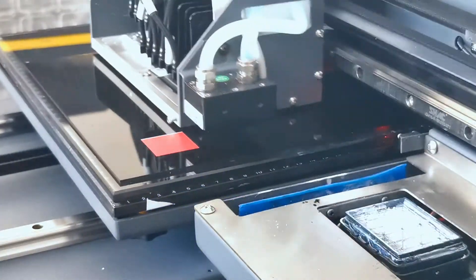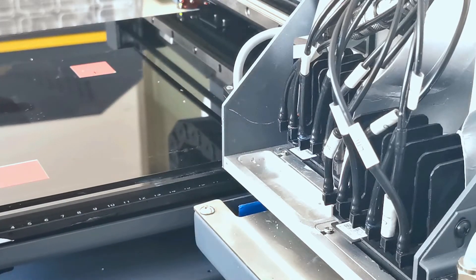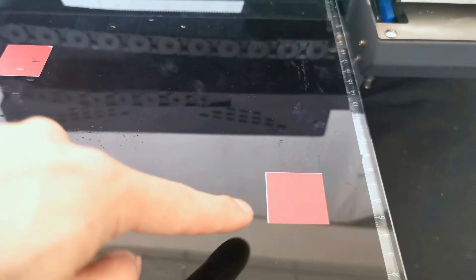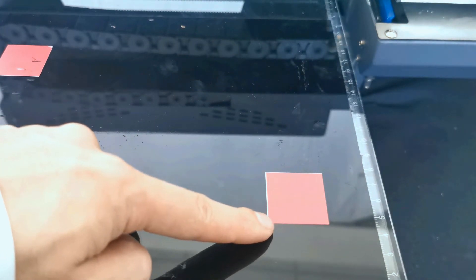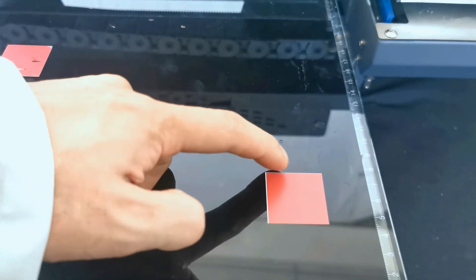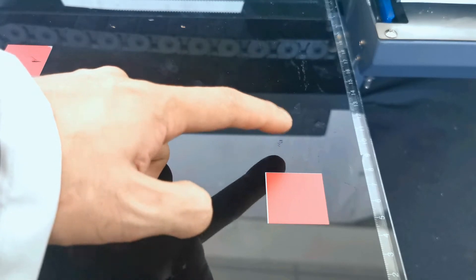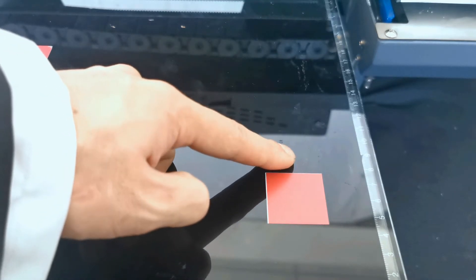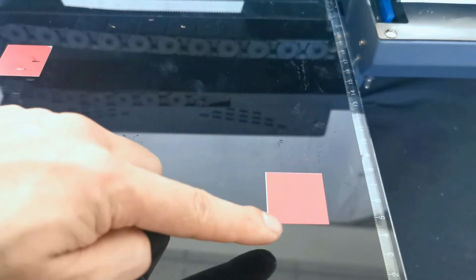You need to open the UV control box. After print, we can see the white ink overlap. That means the color needs to move to the left. And also on vertical, there is a little bit of white ink overlap at the bottom side — like this overlap — but not covering fully. So we need to go to the software and do some settings adjustment.